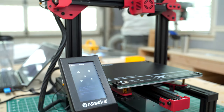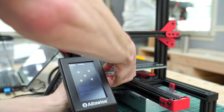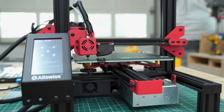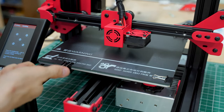Now that we've got this thing up and running, the paper manual is pretty much done for installation. There's actually a full PDF with better assembly instructions on a USB stick. What we're going to do now is level the machine — it has automatic leveling where it moves the gantry around. They suggest the method of using a sheet of paper to make sure it just barely catches on all four corners. The leveling is working out pretty well so far — it was way too far down to start, but now I've got it where the paper barely catches.